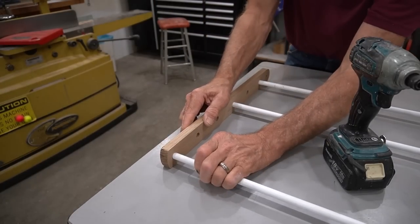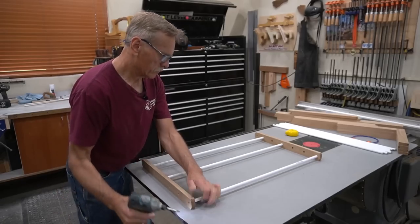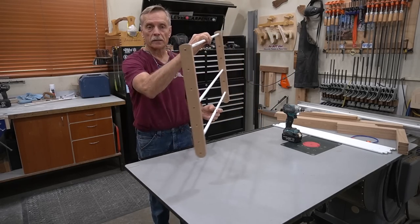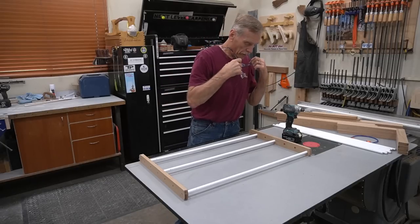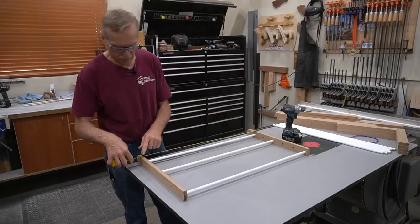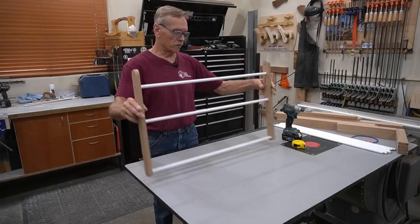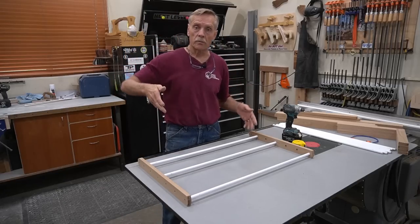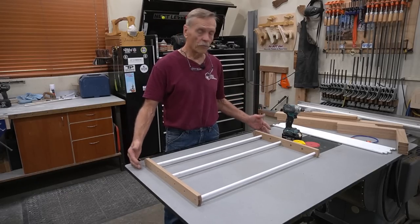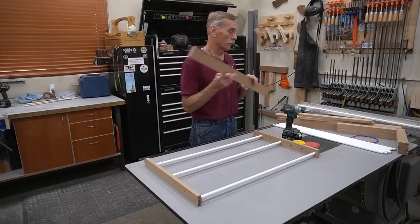With those steps complete, I partially assemble one of the drying racks to get an overall width measurement necessary for the next step. The outside-to-outside measurement is thirty and three-eighths inches from wood to wood. I'll add another eighth of an inch or so so that the screw heads clear when the rack is folded down. To ensure those screw heads don't scratch anything in the down position, I'm going to make a couple of spacer washers for each side of the arms that will add to the overall width and help determine the width of the rack and ultimately the length of the cleats that hold the rack to the wall.